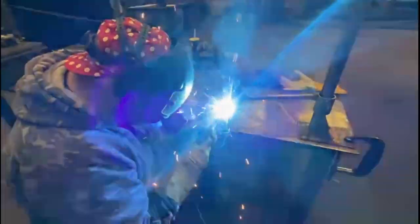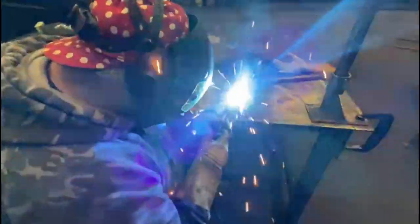The aim is to get as much heat into both sides as we possibly can and to fuse into that plate. The reason we do a weave is we're creating a cold spot on each side so that we're controlling the heat, so that gravity doesn't get hold of it and drag it all into the center, creating a saggy weld with undercut on both sides.